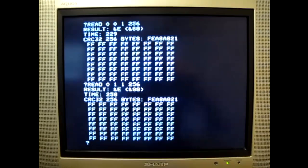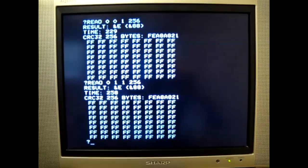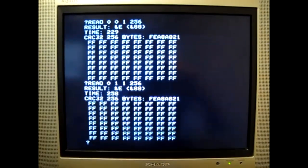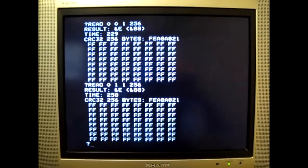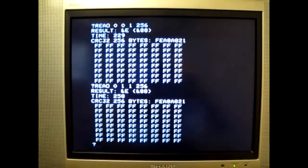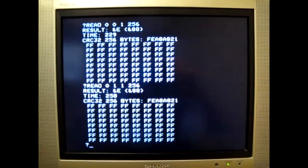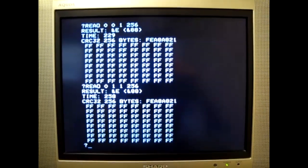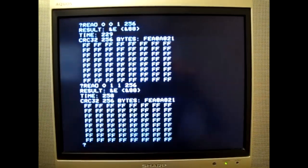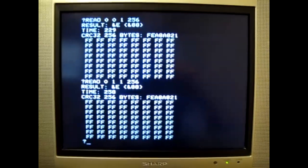This is a very powerful and fundamental copy protection method used, I think, in the Amiga days quite a bit, because it really is difficult without specialized hardware to write bytes to the disk faster than you should be able to. I mean, the disk controller has one job really, which is to write bytes at exactly the right speed. So that demonstrates that Oiled Otter was able to write a successful long track copy protection.